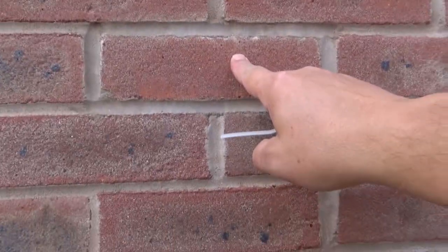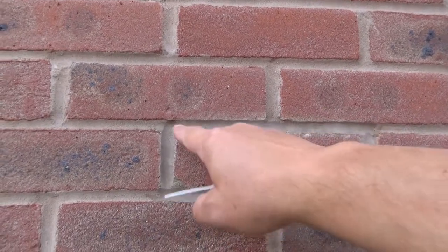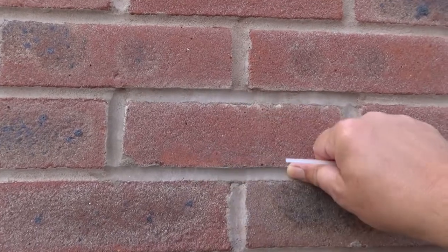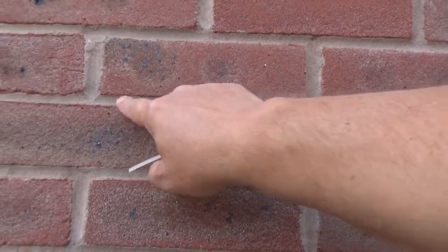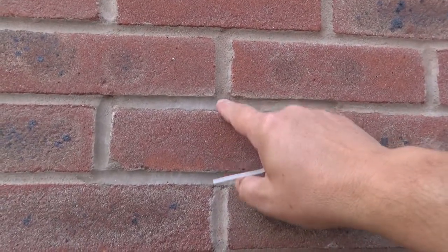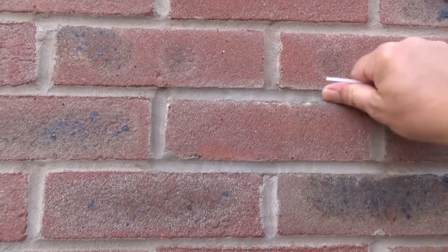Moving down to this area — this is the brick that was removed when Brie visited to inspect. They removed this brick and took it out for sampling. It's now been just over nine weeks since this brick was removed, and that mortar is obviously set and cured, and it's rock solid compared to the rest, because this is properly mixed mortar in the correct proportions.